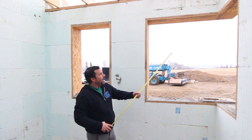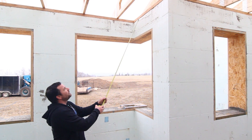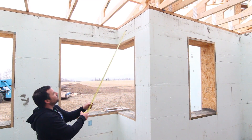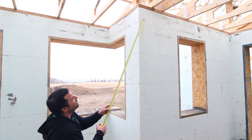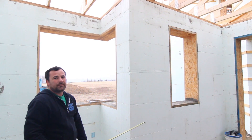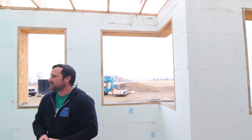If you want to do the double-safety approach, it wouldn't work with wood because you don't have twice the width back. But with rebar and concrete, I can just take this lintel — which is essentially rebar and concrete — and wrap it around the corner, and that gives me my strength. It's all monolithic. Let's show you a few more of the windows.